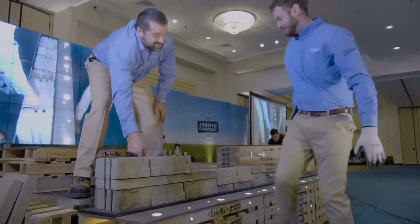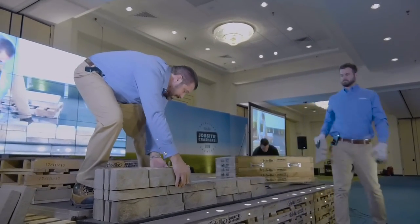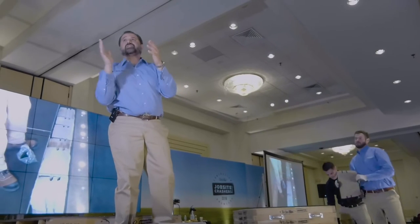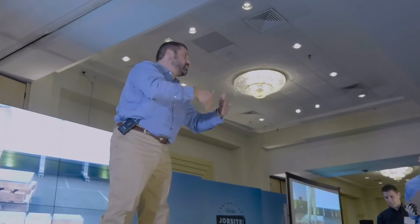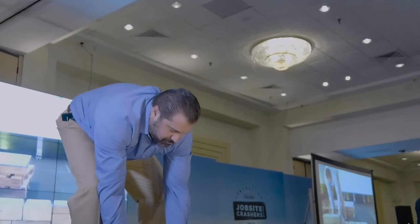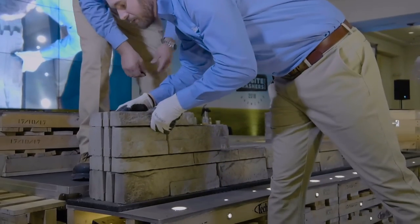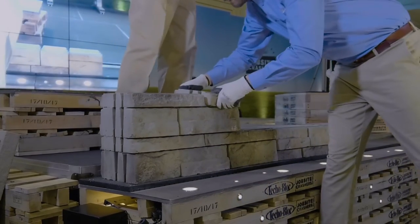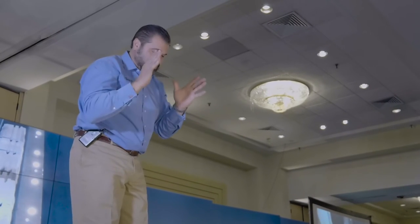When I put the clip in there, you're going to see there's a little bit of play. You always want to front justify the block. You don't want lateral load pressure — that's the earth — or hydrostatic load pressure — that's water — to move the block even a millimeter, because that space introduces water, which introduces eventual failure. So make sure you front justify those units. Also make sure as you're setting these courses that you're good and clean between them. We test block-to-block contact — it's called shear strength. We do not test block-to-dirt-to-block contact, only block-to-block. Make sure you get a good solid connection.